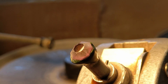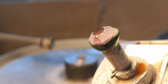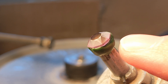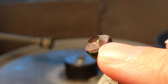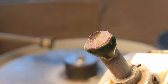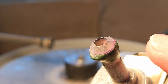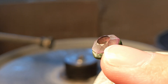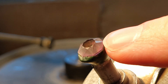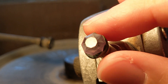There may be one or two little spots in there but I don't think they'll be noticeable to the naked eye. Now you can see the big difference between the polished face and the orange peel faces at 1200 grit. You can see the little shinier spot is a more polished face — there's differential hardness and polishing that goes on with this material. The orange peel is kind of a mix of polished and not polished surfaces.